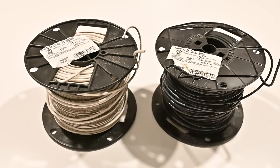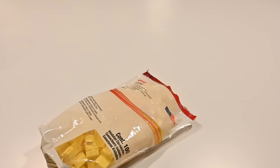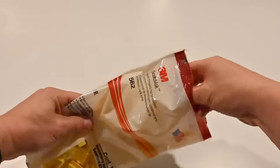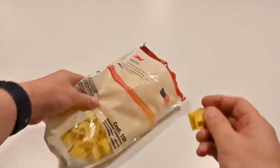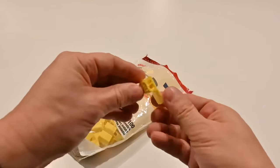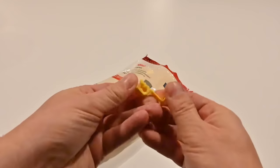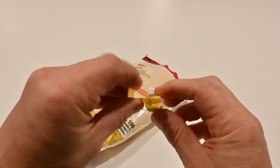For the bus wires, I use heavier 12 AWG stranded copper wire. Now, for tapping into the main bus wires, I use these number 562 Scotchlok suitcase connectors, and I'll put a link below where to get these. They are a solderless connector, and they have a metal blade inside that cuts into the bus wire's insulation to make an electrical contact with the wire.